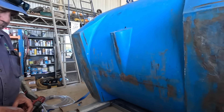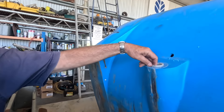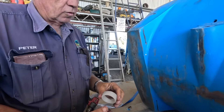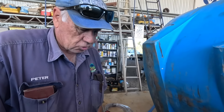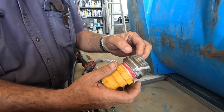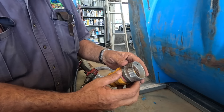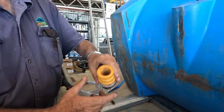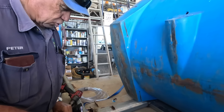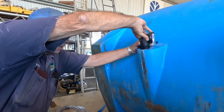Last video it was all mounted on here, but now you're doing a bit of the plumbing. Yeah, that little insert was in that tank and it came loose, and I put water in it and it started to leak. So I've had one or two reruns. I've taken that out, and I didn't have a two-inch tap. So I used a nipple and made a tap out of it, and then threaded that in there - made a two-inch thread straight into that without needing the insert, because Brad wants to upgrade everything to a bigger pipe. We had an inch and a half on it. We all know on the suction side, the bigger the suction side, the better the flow.